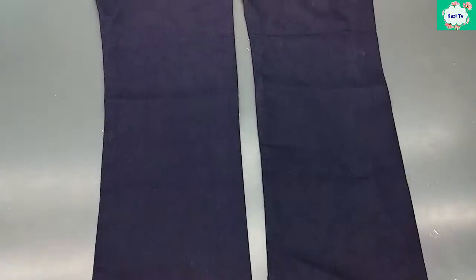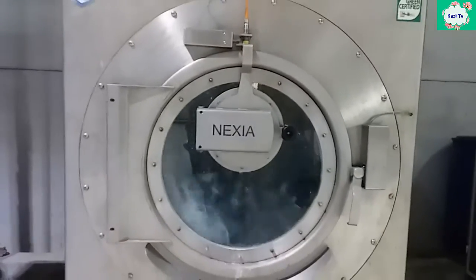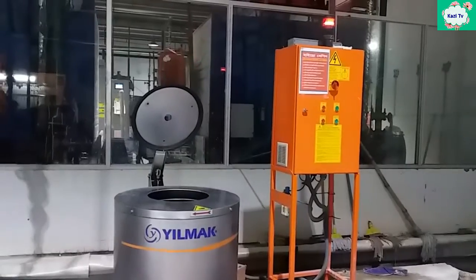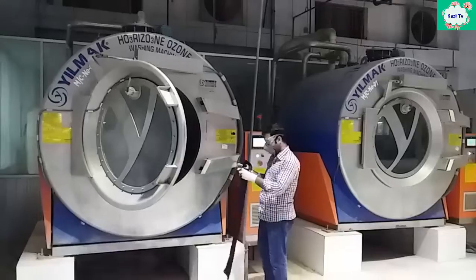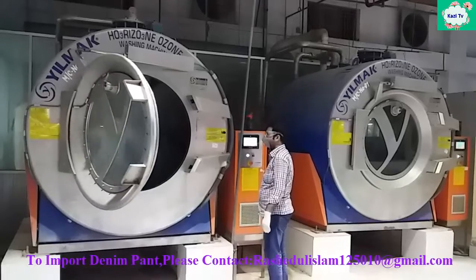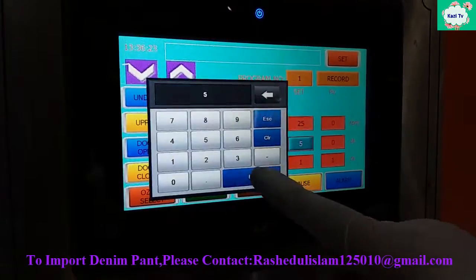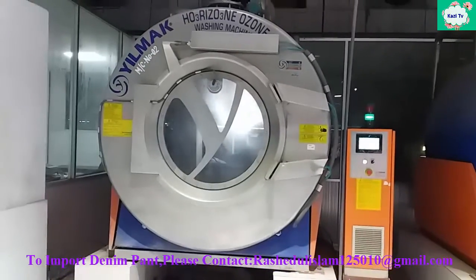You can see here two sample. We will treat one sample in ozone gas. At first the sample has to be rinsed three to five minutes. Then hydro the sample to remove excess water. After that the wet sample is loaded to the ozone machine — select ozone 5000 grams, set five minutes for working time and two minutes for cleaning time. Start the machine. Now the ozone process is running.